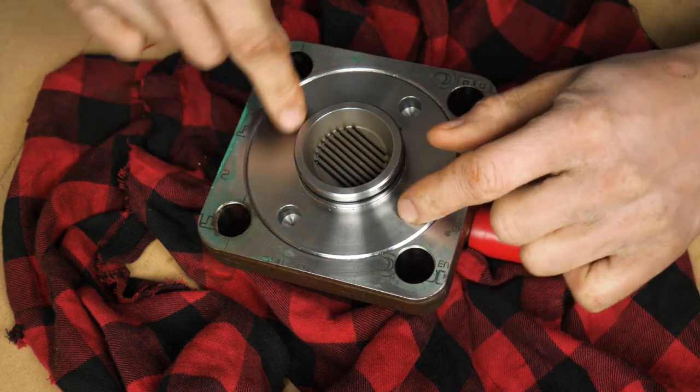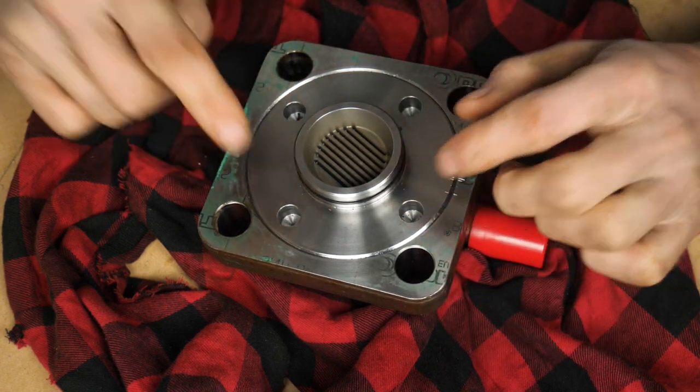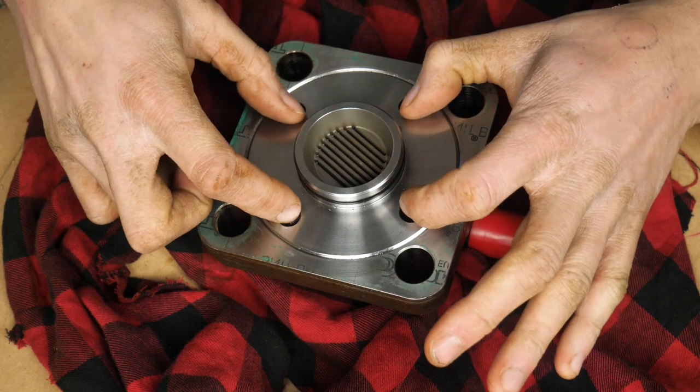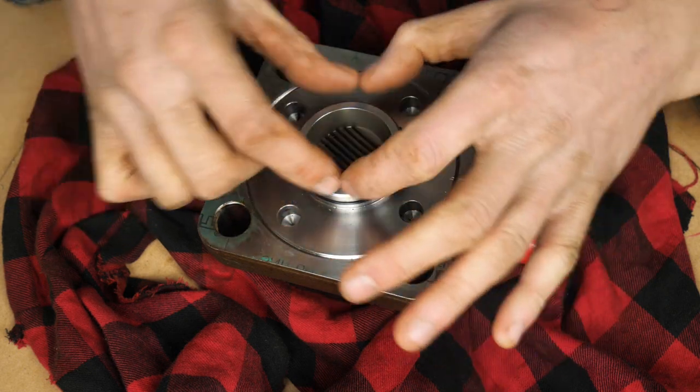This is a threaded section in here and we've got these four pin holes to pick up. There is the easy way of getting this apart, so we're going to need a special pin spanner to go in here, pick up the four holes and clear this.